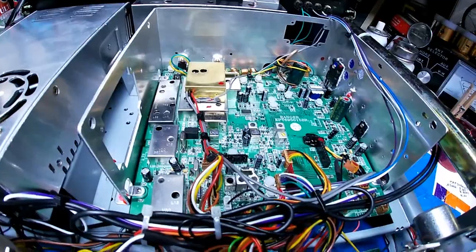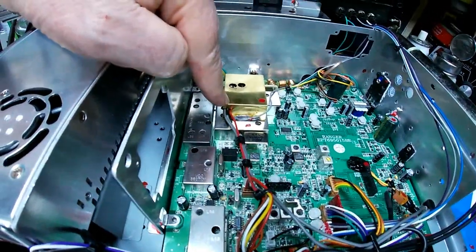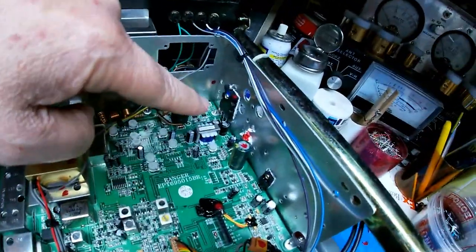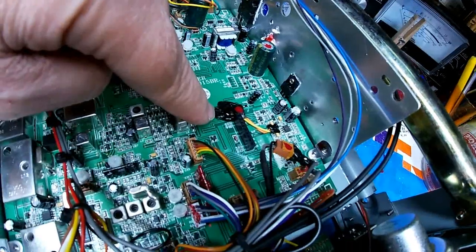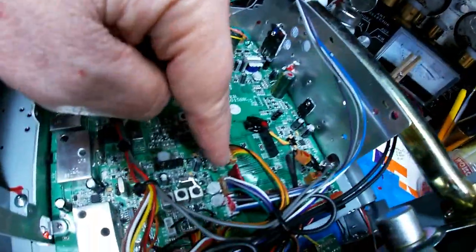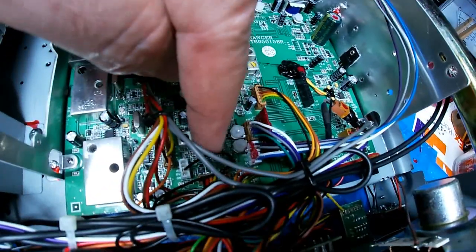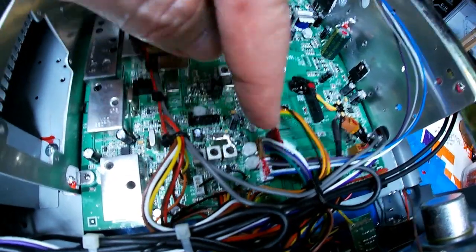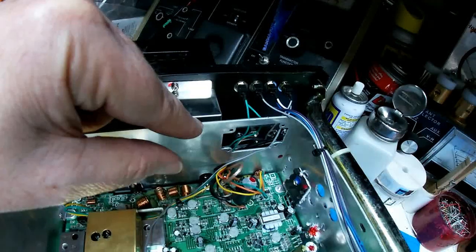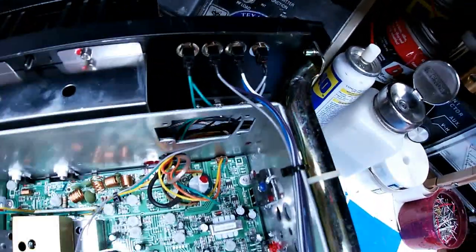Okay, one last shot of the inside of it there. This is your SP1. There's your Palomar Max Mod. There's the CP1. Here is the Lescom noise filter. Okay, the connections for your high cut and the noise filter are on the board. Switches in the back. You can see I used heat shrink on all the pins.